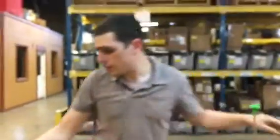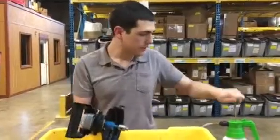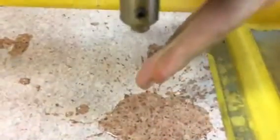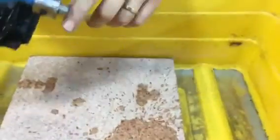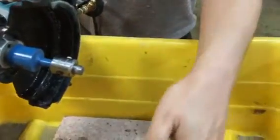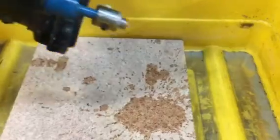I've got the bit already set up on my polisher, so let's get started — get a little water flow going. What you're going to want to do is start off at a slight angle and then go straight. A lot of stone workers want to start rounding out the hole, but this bit is very precise, so you really just want to come in straight once you get the polisher upright.